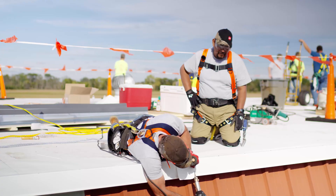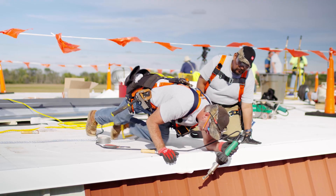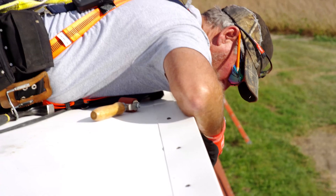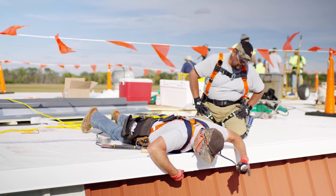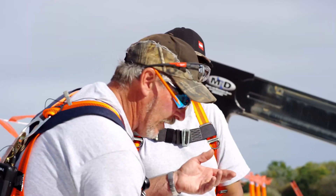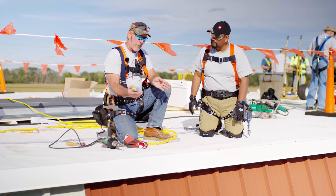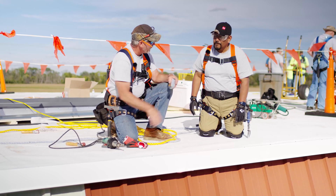This is why we're harnessed off. I'm actually going to tuck it up under this. Okay, now it's done. Now we're going to take our eight-inch and strip it in — we can use six-inch. That's everything nice and neat. If you have scrap eight-inch, whatever size you use, just make it all the same as it's going down the roof.